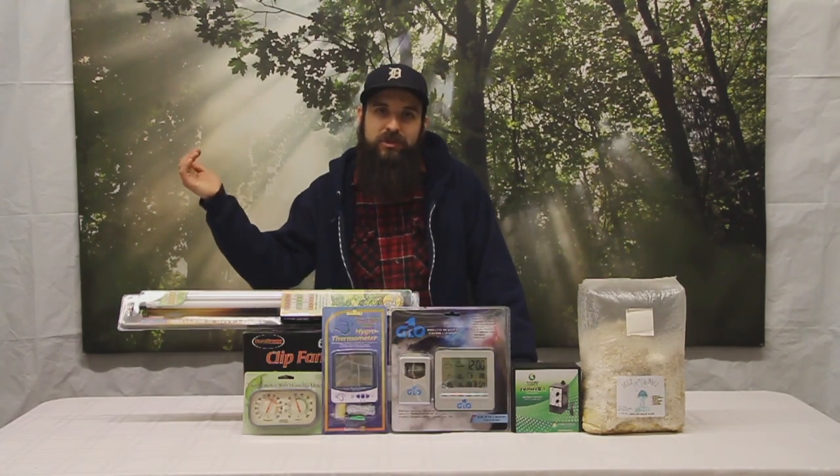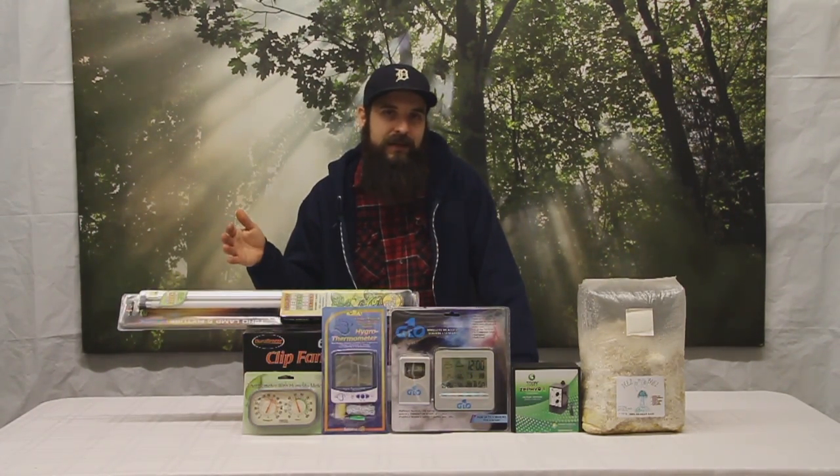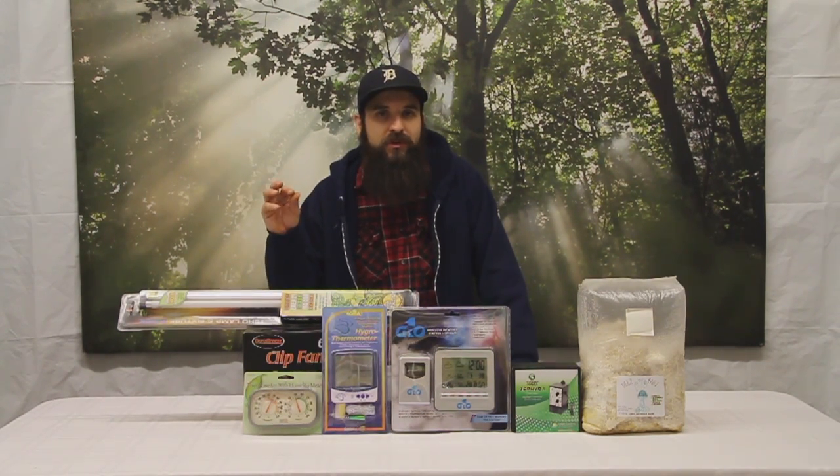We don't want to bring super cold air through our light bulbs and say, okay, now I don't have the heat issue anymore, because those light bulbs have an optimal operating temperature, and if you get them too cold, the quality of light coming off them, the color we were talking about, will start to degrade. So let them do their thing, cool them, but not too cool, and then we have to combat the temperatures in the room.